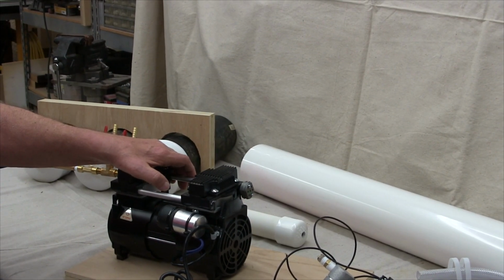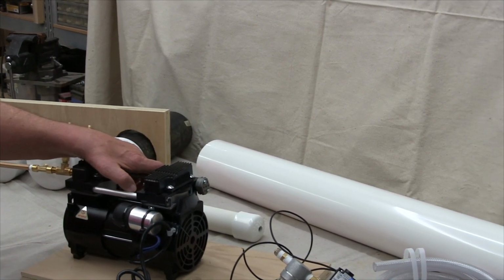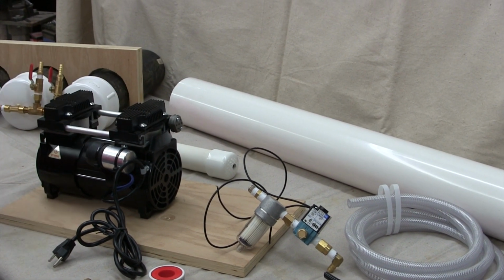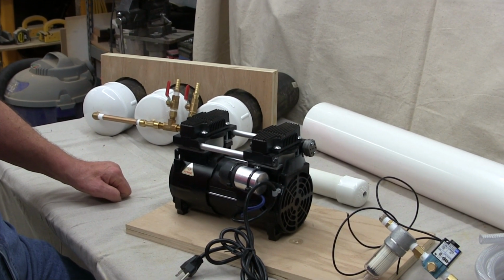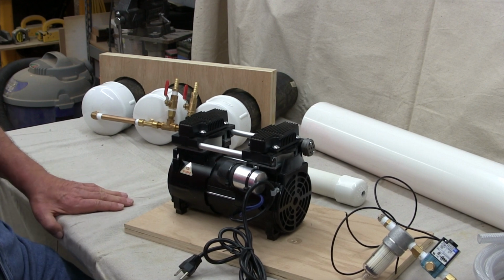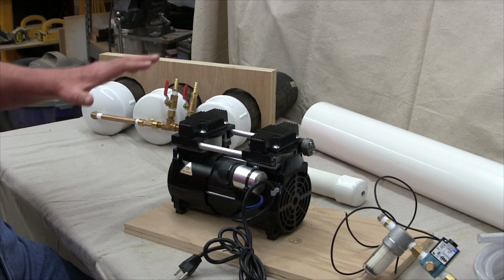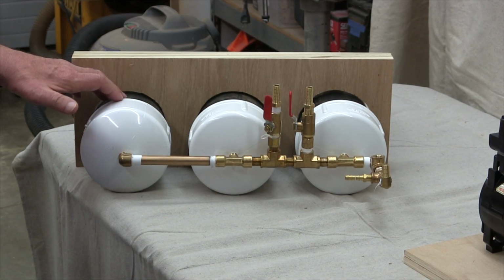It can be one piece, as in this one pipe shown here, or it can be several pieces connected together with piping. It could be metal or plastic of any shape as long as it will reliably hold 120 psi of air pressure. I use air pressure to explain that a container capable of holding 120 psi of pressure would certainly hold 22 inches of vacuum.